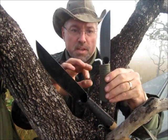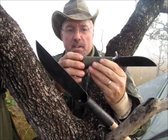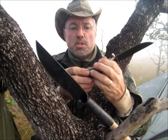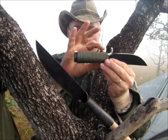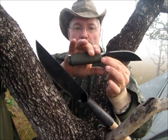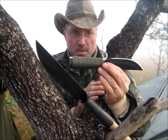I've also set this one up with a finger guard. When the cord wraps on there, the round profile of the handle doesn't index very well in the hand. I put a little bent bar of aluminum in there to act as a finger guard, but it also makes the handle not round, which allows it to index. When you pick it up in the dark, you know exactly which way the blade is facing. The cone-shaped handle tapers towards the blade, so any kind of slip or shock could easily slide your hand down onto the cutting edge. For a kid, definitely set it up with a finger guard.